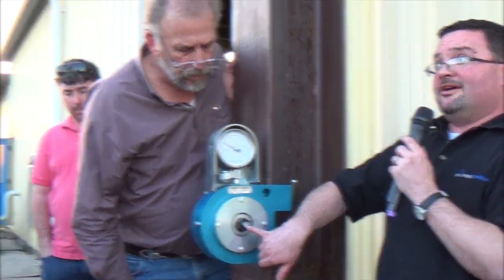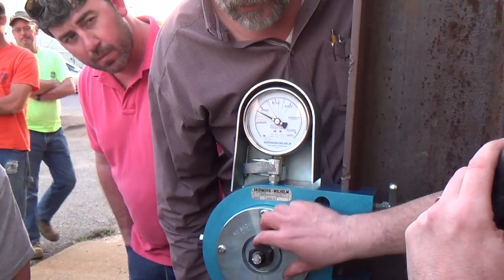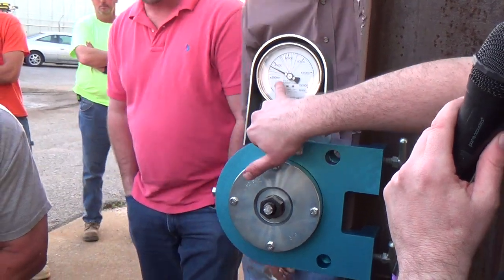You can see that this bolt sheared in torque. The question is: was the lubrication correct so that the torque equaled more than the minimum required tension on this bolt?